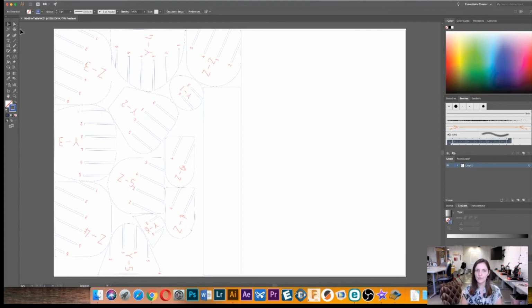So we're not done yet. We want to now get it ready to be laser cut. So we are actually going to vector cut all of this, but on very different settings, because we want our slices to cut all the way through, but we don't really want our text to cut all the way through. That's very unnecessary, and we can do something else for that. First thing we're going to do is create 2 layers. When you show up to laser cut on the laser computer, you should not show up with 1 layer. You should show up with 2 layers, okay?